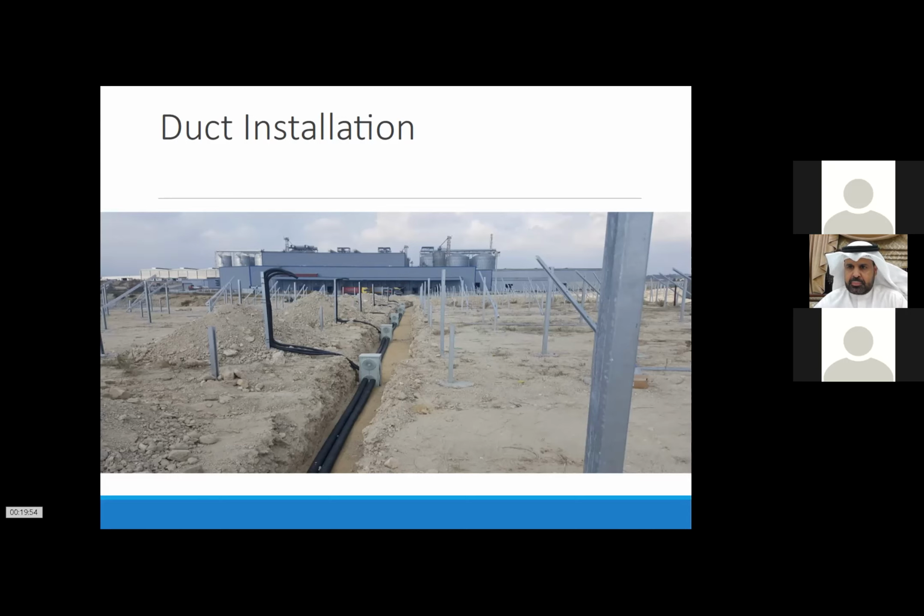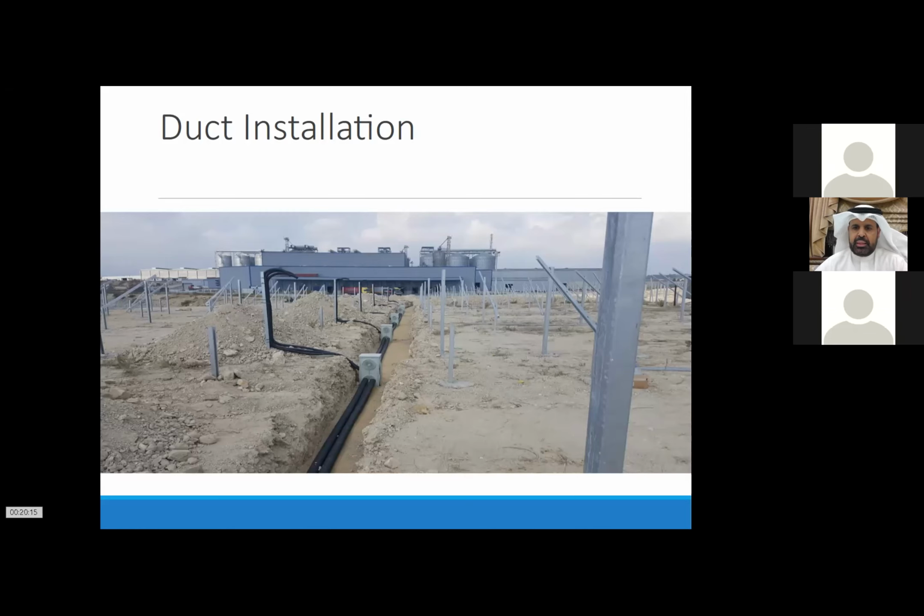When the connectors are faulty, or when it's wet, or during morning dew, I don't know when he gets the shock. But if he gets the shock when it's wet, or like I said, he always gets the shock, then there is most probably a problem with the earthing at his house. So they forgot to earth something, so there is no return towards the inverter. Okay, thank you.